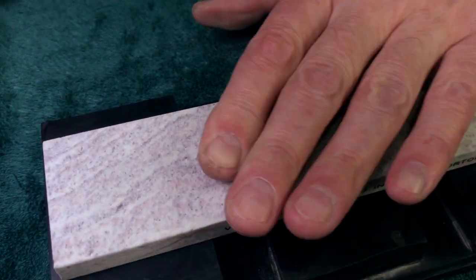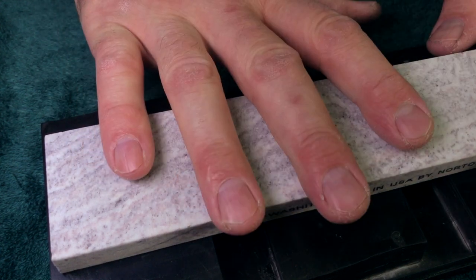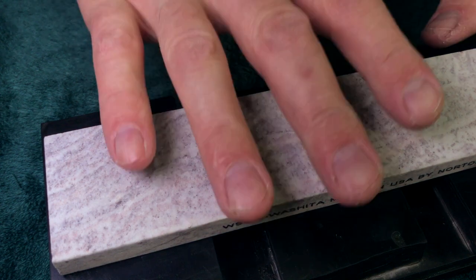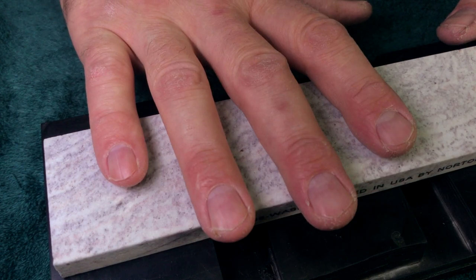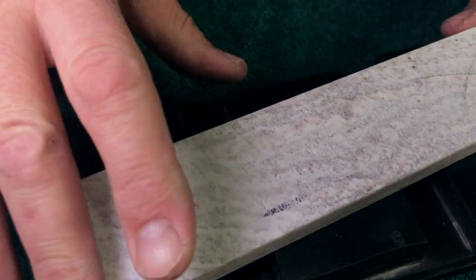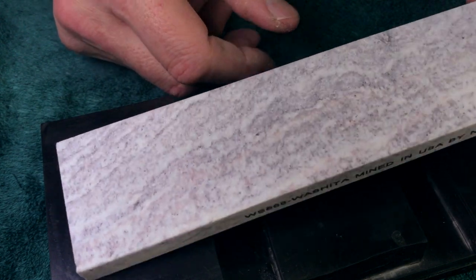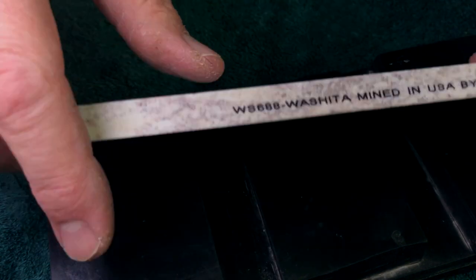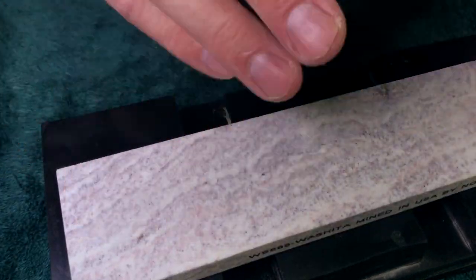So there's that. I think this will make a nice axe stone or a good general purpose stone, good for a toolbox, good for a quick cleanup of a chisel, good for a heavy duty knife blade. Maybe not for a super fine refined edge type of knife, but for a general purpose, you know, kick around blade, yeah, sure. Stuff like that. It'll work. Thirsty as hell. Whatever you put on it soaks right through. The porosity is incredibly open. So there's that. But I thought it was kind of cool, and I think it's neat that Norton's offering this type of thing. It's a little different than the regular offering. So anything to do with new stuff is groovy, right? Well, it can be. So there's that.